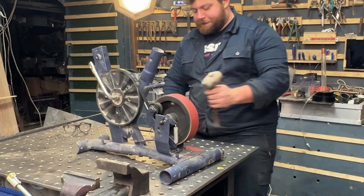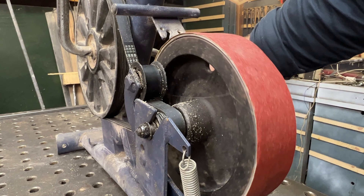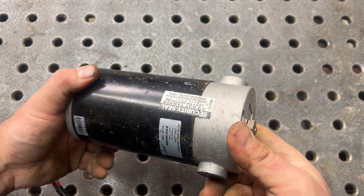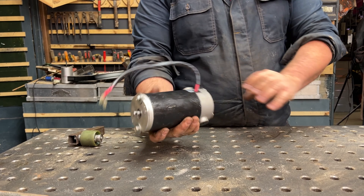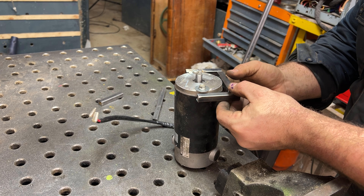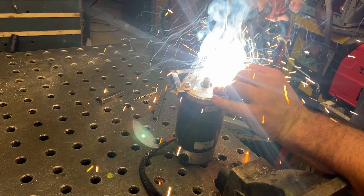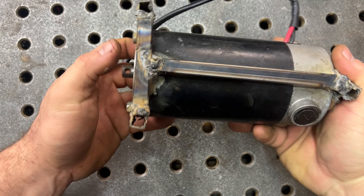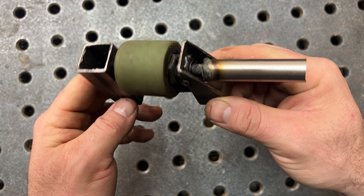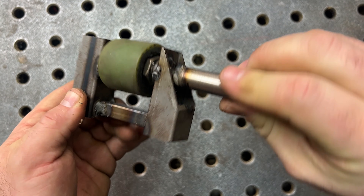After installing the belt, everything is so silent. The more silent it is, the better, because I plan to use it indoors. So everything is working, nothing is creaking. We can then take the motor — this is a 24V 300W DC motor, which means inside there are magnets. That's the reason why it can produce electricity. I'm then welding a little frame so I can mount everything on top of the exercise bike. When you weld, just do things very fast, because we don't want to bring heat to the magnets — otherwise they break.